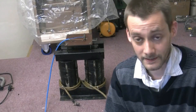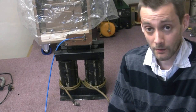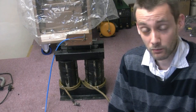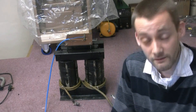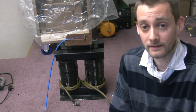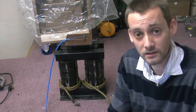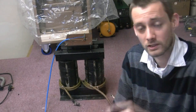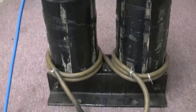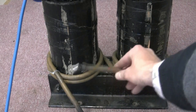That job was extremely easy. We've seen now how easy it is to get a decent-sized transformer — 24 or 20kVA — rip out the secondaries, leave the primaries where they are. That welding wire there is just a quick test to check that I've got both coils in phase, because if you get them wrong, one will just cancel out the other and you'll get no volts. But I've got to get some wire which will be ten times this thickness, at least.